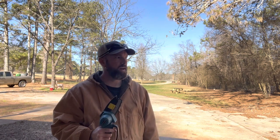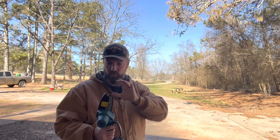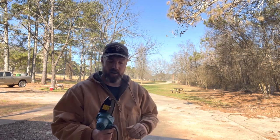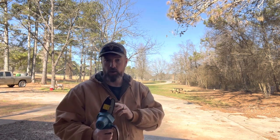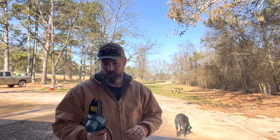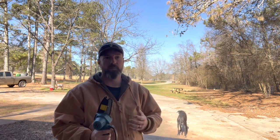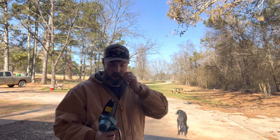After about a little over 30 minutes of continuous use cutting down trees, branches, and vines, a few things I've noticed. I've just now had to tighten up the chain — it was getting a little loose and sagging, but tightening it was super easy. I've also had to put bar oil on the bar two times now. The bar is really small and since it didn't have a reservoir I had to keep stopping to do that, so keep your bar oil with you. But it's been cutting great and I haven't had any issues with the cutting so far.